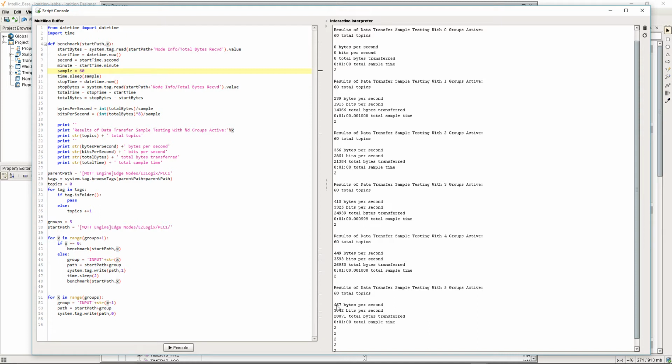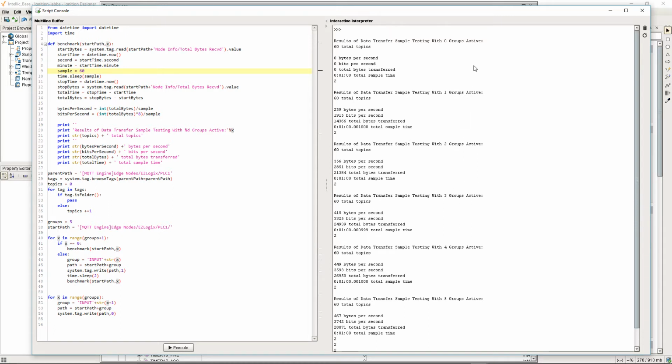That's not typical. Generally, for every 100 OPC tags you have in an OPC server, only 7 of those change every 60 seconds. So this would assume that we have a bunch of high-speed transmission. I really want to push the limits and see just how lightweight the MQTT protocol is.